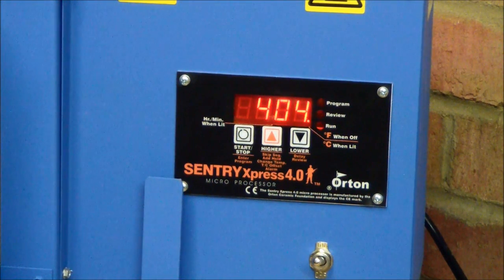This is the three-key digital controller which controls the kiln. It's telling me that the temperature is about 405-406 degrees centigrade. It gets this information from the thermocouple within the kiln itself, so it's a very precise and accurate way to heat treat your blades.